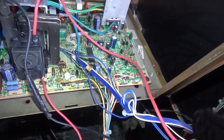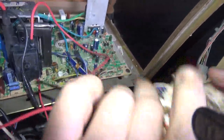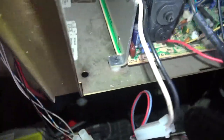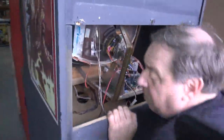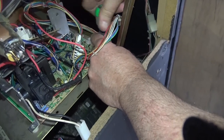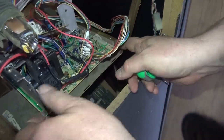We're all done unplugging everything except the power plug. Now the last step is removal of the chassis. Your chassis is going to be held in by either two quarter-inch or two Phillips screws — just two, that's it. We're going to pop them out. Let me get the Phillips, take out the two screws, and we're done. We'll get this in a box and on its way. But we're going to do the second part of our video — showing how to put a chassis back in.